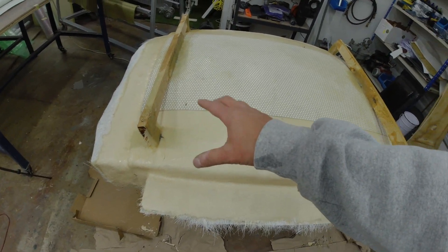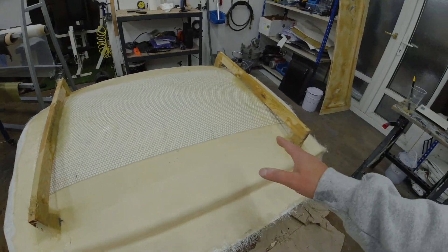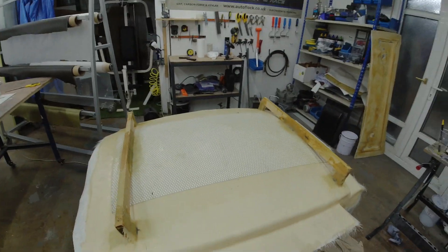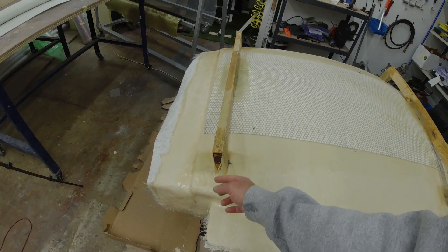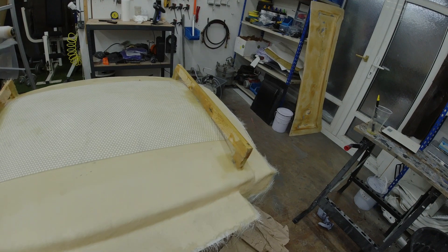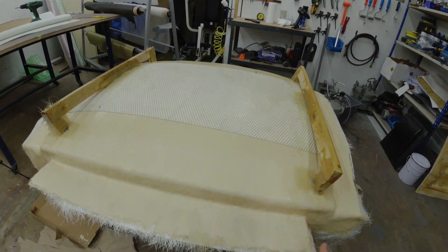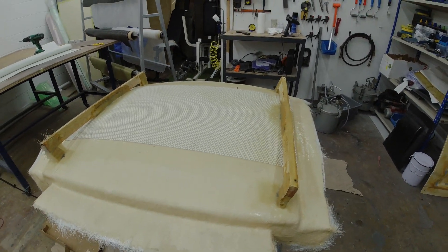This will not only add some rigidity to it and stop the curvature changing, but it'll also make it a lot easier to work with — it'll allow it to sit steady on the table tops when we're using it. What I'm going to do now is just take it outside, get these sharp edges all smoothed off with the buzz gun, then we can turn it over, pull the plastic flange off, trim the bits around the edge of the perimeter, and then we can attempt to hopefully break the roof out in one piece. Let's see how we get on with that.